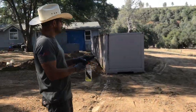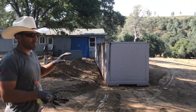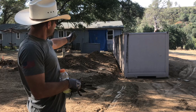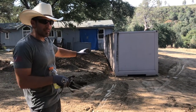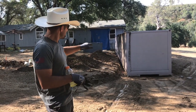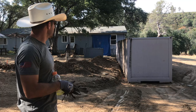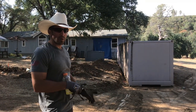So she's finally in place, and as level as we would like it, because we actually positioned it to tilt a little downhill and a little back so that the rain can go off and back and not come to the inside and erode that. We used just some cement pavers that will eventually settle, but we cut into native ground so it shouldn't compress much more. We're gonna fill the rest of the dirt to the bottom to keep rodents out and whatnot, and then they'll put a little stairway to the front so they can access the front to put all their stuff in it.